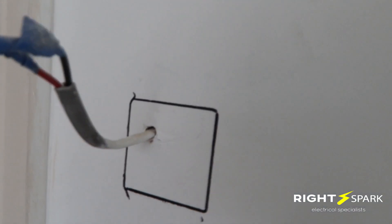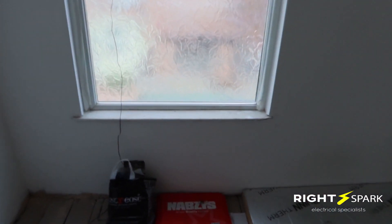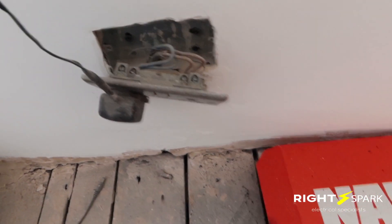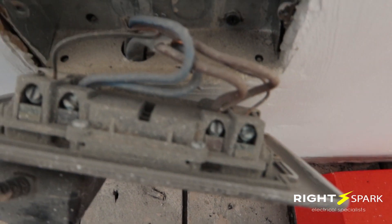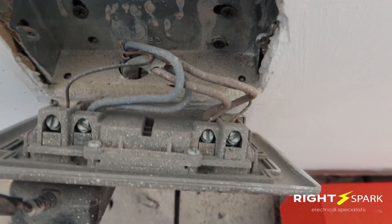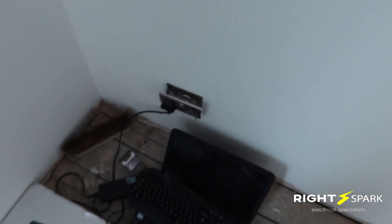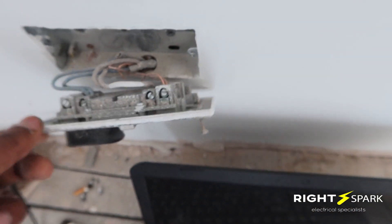In another bedroom, there's a switch wire that's live again, just taped up. I'll cut that out, put it back in a back box, and fit a proper switch. In this bedroom there are six spotlights and two double sockets. When I opened the sockets, there's no earth sleeve and no grommet where the wires come in. I'll have to take the socket out, put a grommet in, and fit an earth sleeve — every socket I've opened is exactly the same.